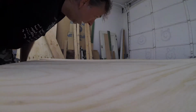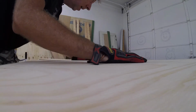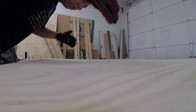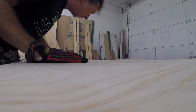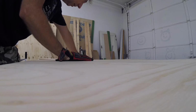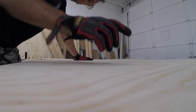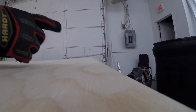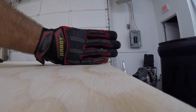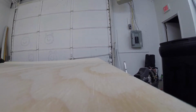Okay, so we've laid 2 sheets of 4x8 plywood down. That creates a perfect 8x8 square. Now, the dimensions of the gypsy wagon are not going to be 8x8, so we're going to use some subset of this. This line may or may not be exactly in the middle. What I'll probably do is I'll presume that one of these sides, like this one, will be one side of the gypsy wagon. And then we'll see where we have to make that cut to come in from the outer edge, and then make that other cut to come down.